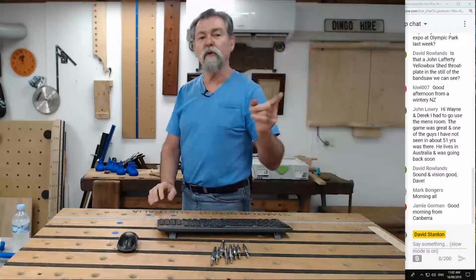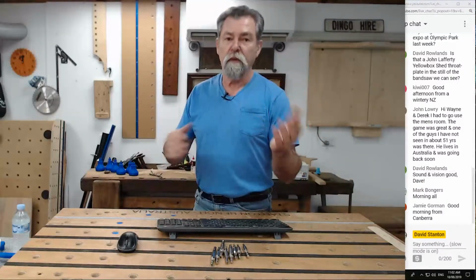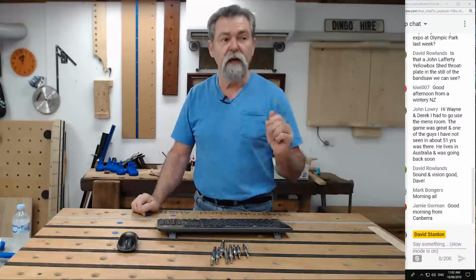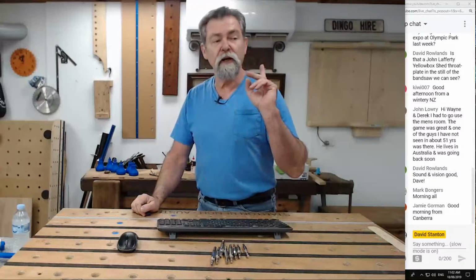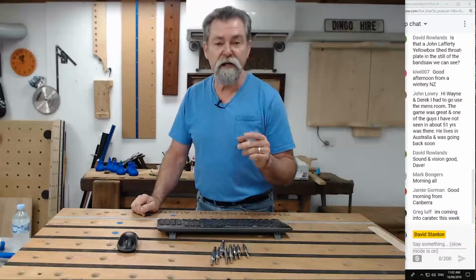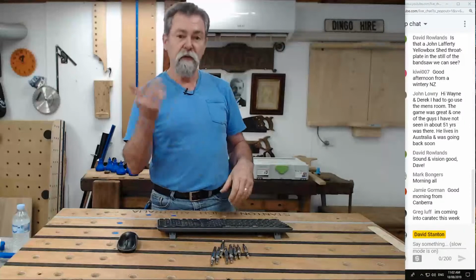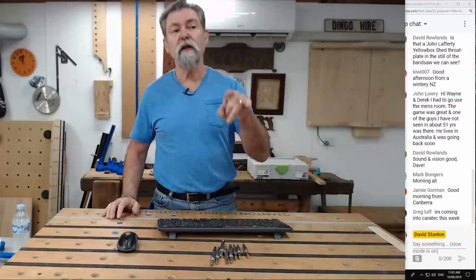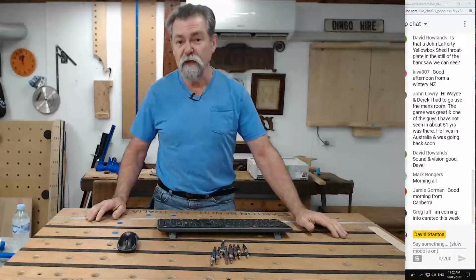All right, next thing. We're going to have a look at Arthur's bullnose plane, and I've nearly finished cleaning it. I'm just going to give the one face or one edge of the plane a quick buff on the Sorby Pro Edge. I'm going to pull the blade out and run it over the Triton slow speed Waterstone and try and give it a bit of a clean up on the back, and then I might even try and touch up the bevel. We'll see what happens. I'll either use it on the Triton or else I'll throw it onto the Sorby, or if we run out of time I won't be doing any of that.